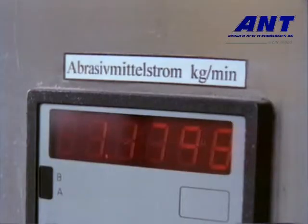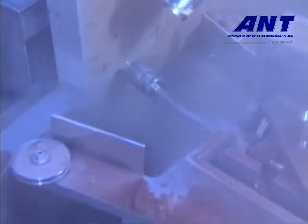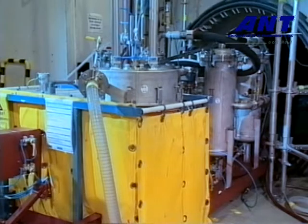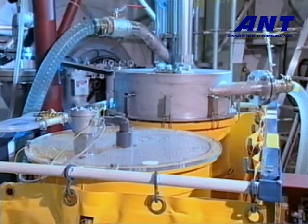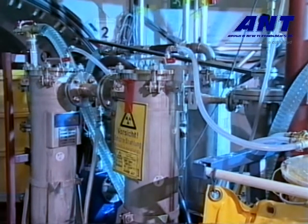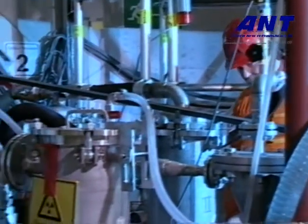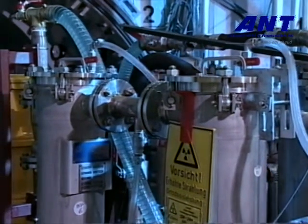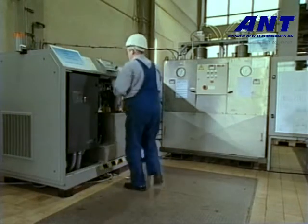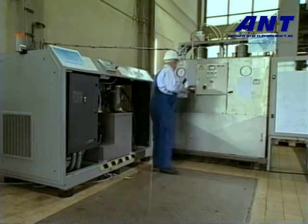The hydrojet develops the aggression it needs with the aid of this abrasive agent. At first, the cloudy water caused by the abrasive agent disrupted the work, but this problem has also been solved. We developed a special water cleaning device, now registered with a patent. The dirty water is not only cleaned of suspended matter, but the radioactive contents are extracted simultaneously, then packed on the spot for final waste disposal in these yellow drums. Another remarkable advantage was being able to operate the device away from the cutting site, or the control area, thus ruling out any risk of contamination.